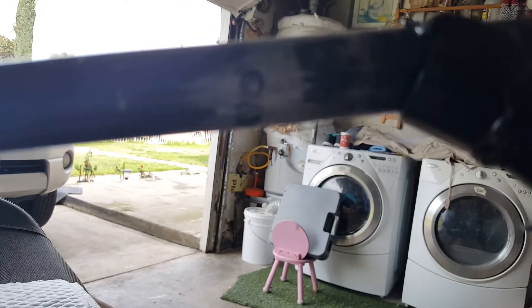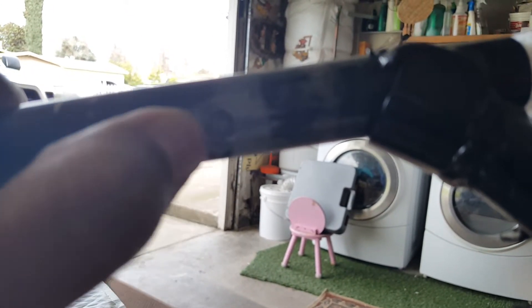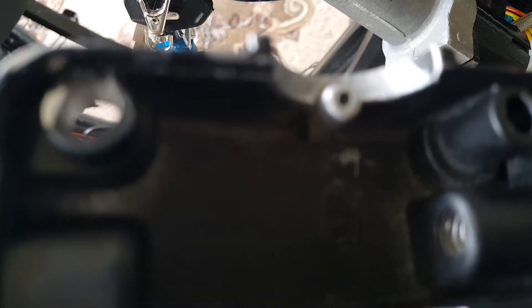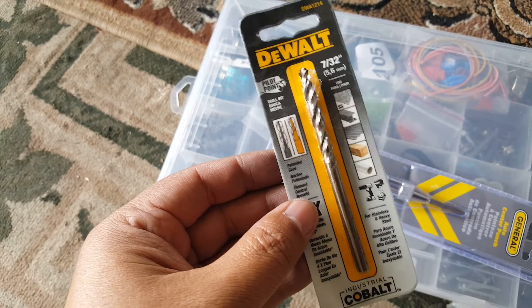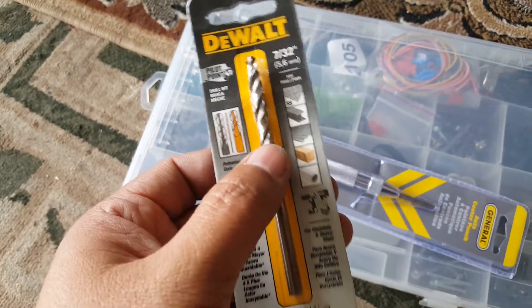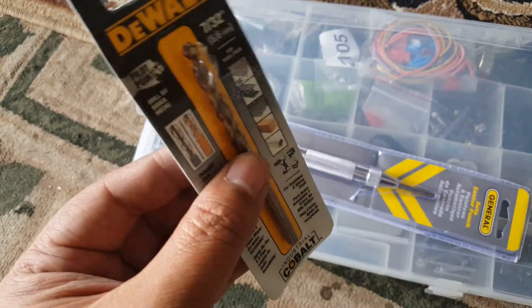You can see here I pre-drilled one — this is the original one right here. I can see why it was almost loose because I believe the holes kept on eating the aluminum, little by little, making this smaller. The one that we drilled was perfectly small. We used this drill bit here — 7/32 of an inch. It's perfect. You just tap it in a little bit and it'll force in there, nice and snug.